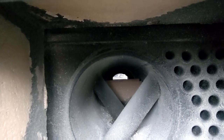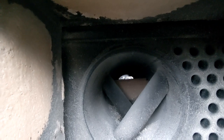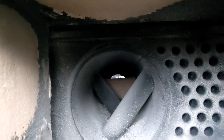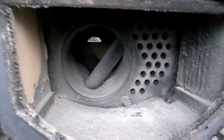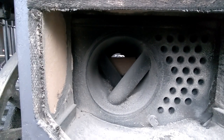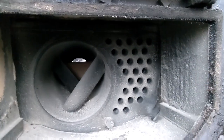So as you can see, the fire is just behind that baffle plate. So you light the fire in there, obviously the heat builds up. We close the firebox door. So obviously underneath you've got the ash pan, which allows air under the fire to keep the heat going. The hot gases then pass through that main boiler tube. It passes over these two cross tubes into the general smoke box area. And then the hot gases flow down these many sort of small tubes. And those tubes run all the way to the back to the chimney stack. So the idea is, with your fire going, air getting in from underneath the fire, from the ash pan, with the firebox door shut, the smoke will naturally be drawn through into the smoke box, through the tubes and up out the chimney.